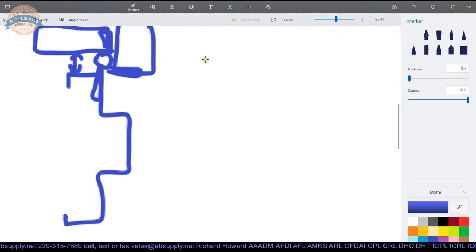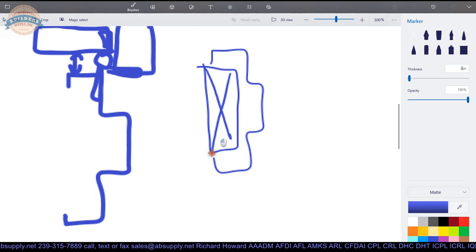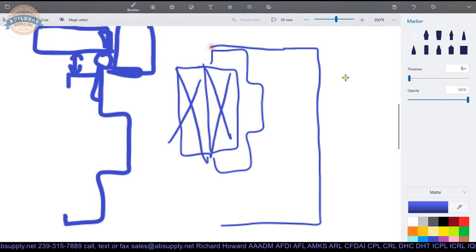So in a scenario where you have a steel frame at your favorite local coffee shop, partition construction, a couple of studs, that frame wraps the wall. You have no clearance issue. And the inset is probably 3/32 of an inch. Well, let's consider this option. What if we've got a masonry wall, an 8-inch CMU wall, and now you've got a 5 3/4 frame? Where you put that hinge barrel has got everything to do with what's happening here. So if you want to go to 180 degrees, you're going to need to figure out what the clearance is. You're going to have to add for that, is the bottom line.